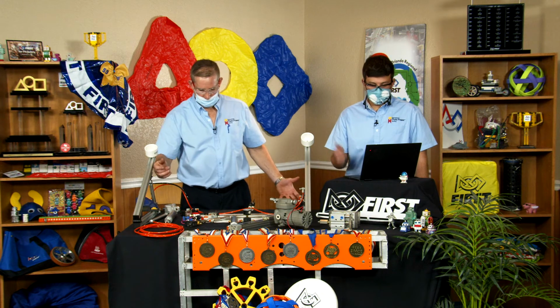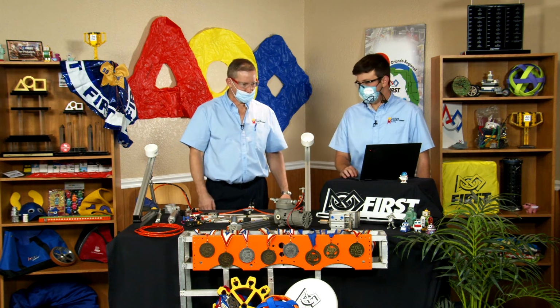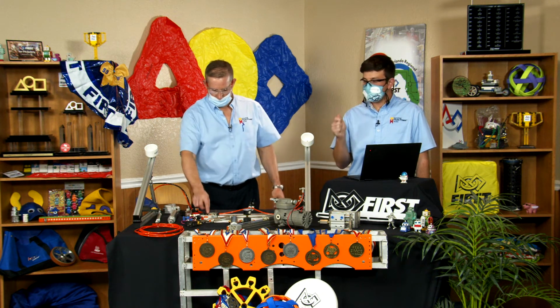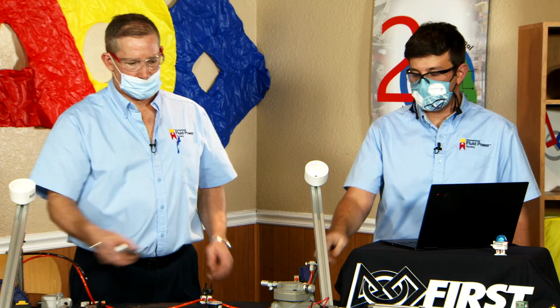In detection, use your ears and eyes. Luckily with pneumatics, when you have a leak, it doesn't also get messy. That's not necessarily the case with hydraulics, trust me. But use your ears, use your eyes, and a little soapy water sprayed on the fittings, away from your electronics, can help you find the smallest leaks around your fittings too.